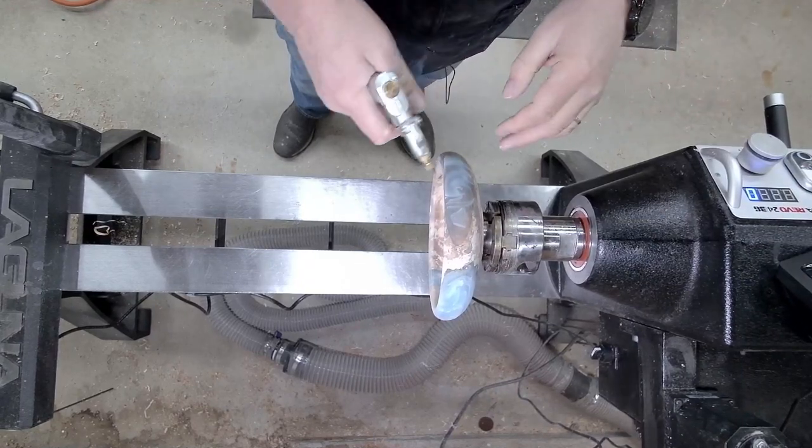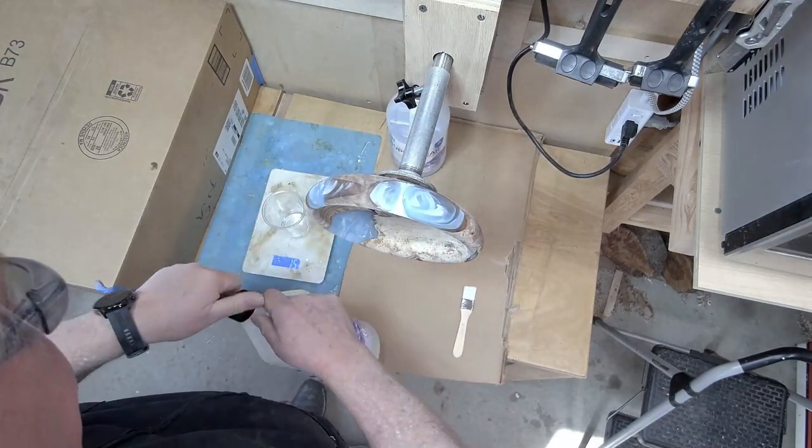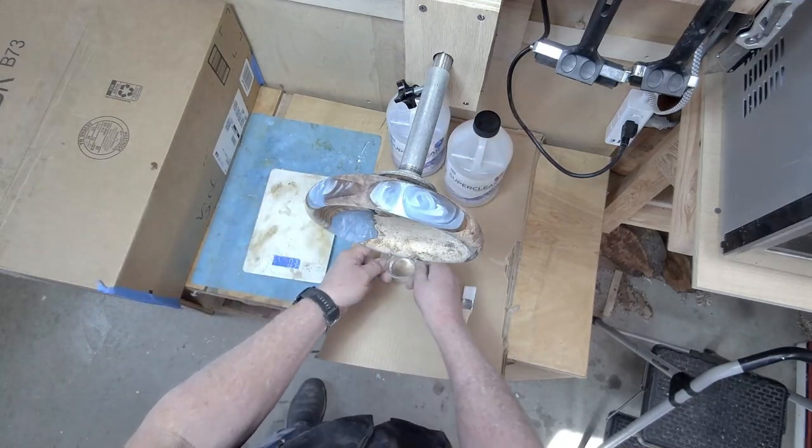One of the things I didn't do, and which I wish I had, looking back now, was to use some of the penetrating epoxy to seal off that maple burl, because by God, it gave some bubbles into the tabletop epoxy. You had to put three coats on in the end to cover up all the bubble work marks.